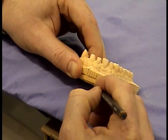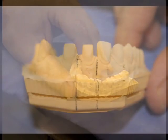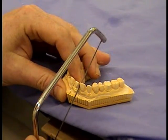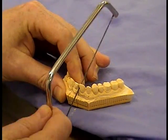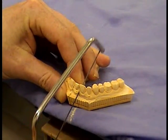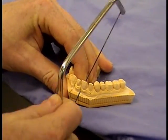You'll pencil out — and this is not just for the benefit of you watching now, you would do this each time, just to know where you're going to be cutting and give yourself a line. You're aiming for parallel lines, because you don't want to build any undercut in, because the piece we're going to relieve in the centre is going to be removed upwards. A keystone shape is probably okay, but an inverted one where it's thicker at the bottom will create an undercut and it's start again time.